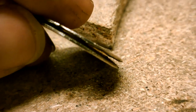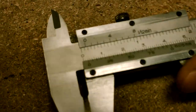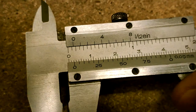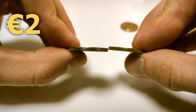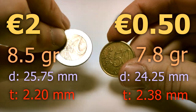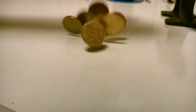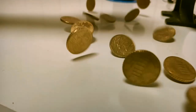So with all this in mind, I decided to start over — this time I did some more research and actually started measuring things for once. Apparently a 2 euro coin is 2.2 millimeters thick. Since this coin has the largest diameter of all euro coins, I thought it would be the thickest as well. Turns out the 50 cent coin is way thicker — 180 microns thicker. Therefore, I decided to switch to a 50 cent coin.